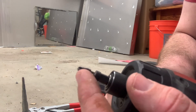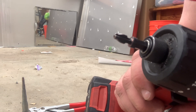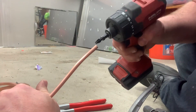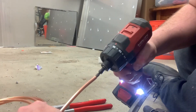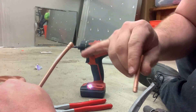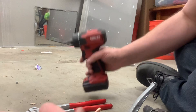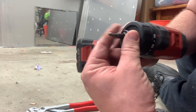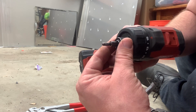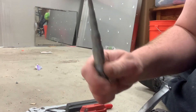The last one I have is a spin bit. This bit is specially made to fit inside of tubing, and the downside is it fits one size tubing only. You use it in a drill — don't use it in an impact; I've tried it and sometimes it works, but sometimes it binds, starts impacting, and does terrible things. This tool is fast and I really like it. You'll notice there's a little smoke coming off — it's friction-based — but it makes a nice deep swedge very quickly. This one I got off Amazon, a no-name one, and it's worked fairly well; I paid about 15 bucks just to try it out. There's also a brand called Spin Bit that sells a kit of four for around a hundred dollars. This one is just the quarter inch — the only size I have — and if I have to swedge anything bigger I typically go with one of the other tools.